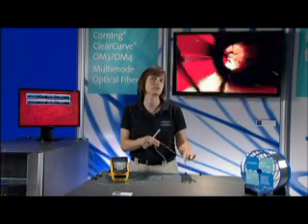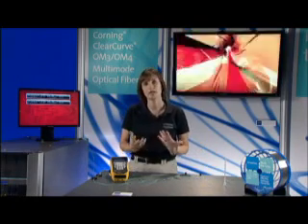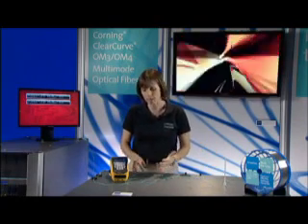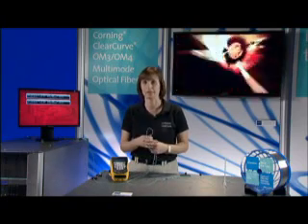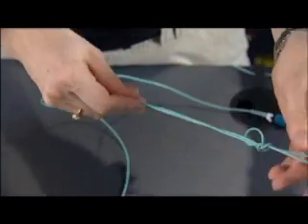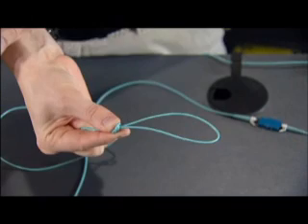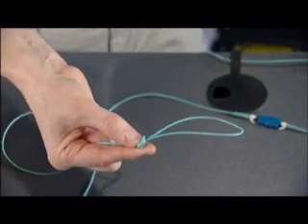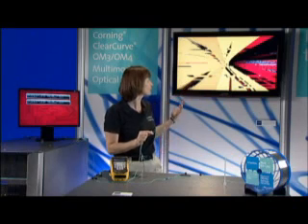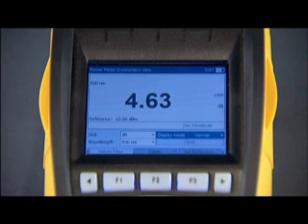Mandrel wrapping is pretty typical of a standards type measurement or deployment, but that's not what you see in the real world. If you pick up a floor panel or look at the back of a data center rack, you may see something that actually approximates more of a knot almost. So I'm not recommending that you actually tie your cable into a knot, but if you get into a situation where that happens with a standard multi-mode fiber, you can see significant pixelization — actually to the point that you've brought the video to a halt. You've now got 4 to 5 dBs of loss in the system and the errors are significant.